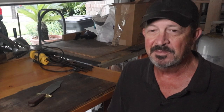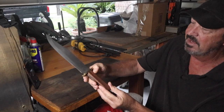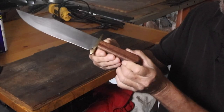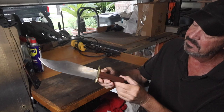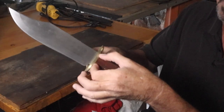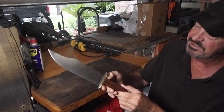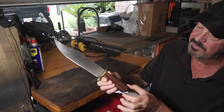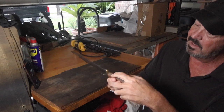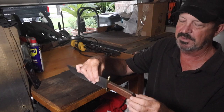In today's video I want to talk about how to make a frame handle for a bowie knife. This is a knife I made recently and you can see it has a coffin style handle. The reason this knife has to have a frame handle is that the width at the butt end is wider than the width up at the neck. If I had just used the tang, I would have had to cut a slot in my guard big enough to fit over the widest part, and when I slid the guard up there would have been a visible gap.